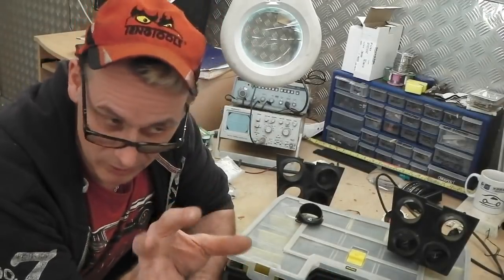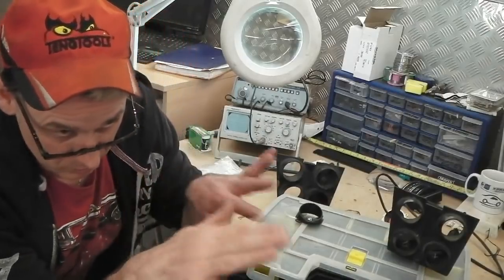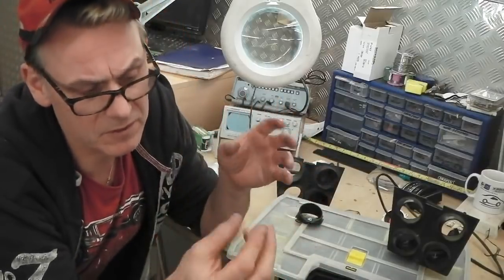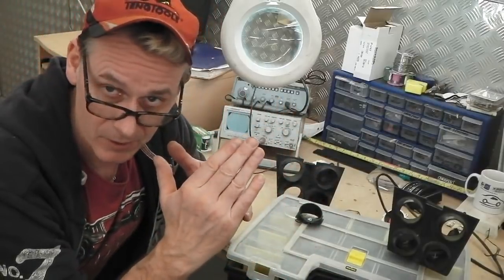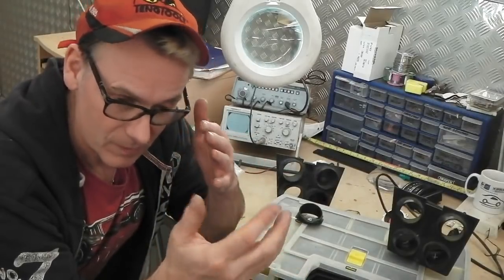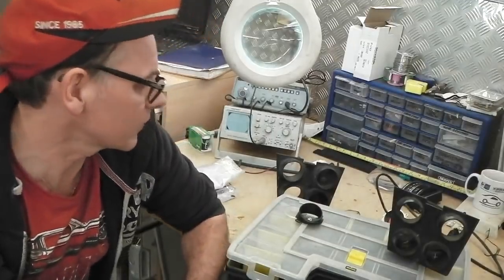So you can tweak the heater box so that when you put the fresh air vent on, it shuts all the other flaps down to create the maximum flow to your face. You can tweak the flap so that it leaves a little bit of hot air that warms your feet when you're getting full air. I'll talk about that when I build the heater box. That's just a little thing that I've noticed.